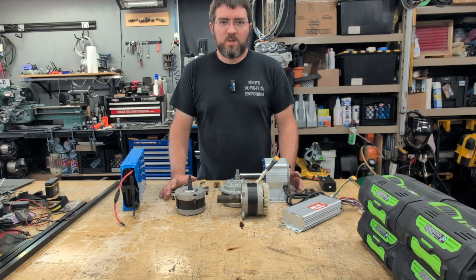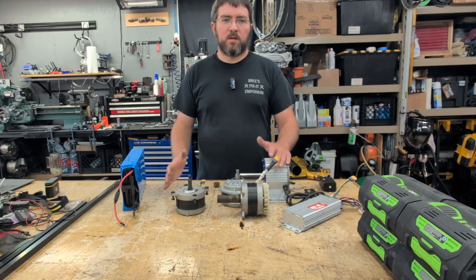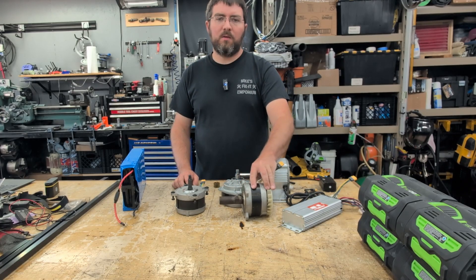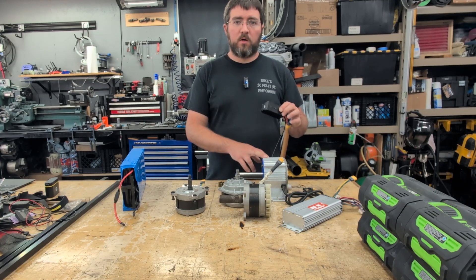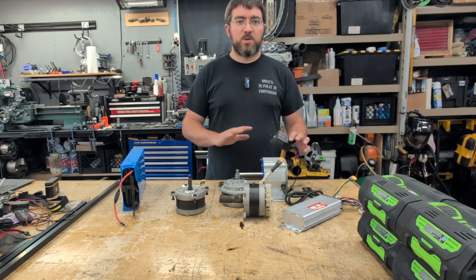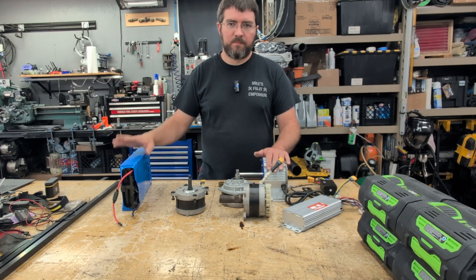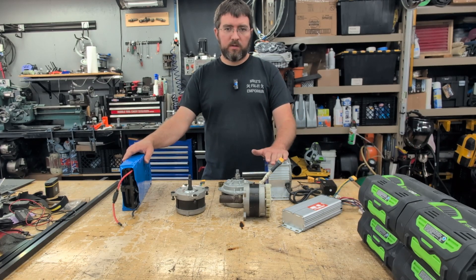The only other modification for version one was to get the batteries in an enclosure — I just used a cheap toolbox to contain everything and wired it all up inside. I mowed with it in this configuration for the rest of 2022. It worked, but needed some upgrades and fixes for the next year. The deck motors were really not strong enough — set to 45 amps, they'd bog down even in a little bit of grass and started overheating cutting normal-length grass. The controllers for the drive motors were also overheating, completely cutting power once they reached 80 degrees Celsius. That's a problem because it's also the brakes — with no parking brake in this version, one minute you're going up a hill, the next you're going backwards down into the street. I also wasn't pleased with the battery setup; the modules weren't as secure as I wanted and the multi-BMS solution was just nuts. The drive motors were also not as peppy as I'd like — even overdriving the 750-watt motors at 3.6 kilowatts, they didn't have the torque I wanted even after being geared down.